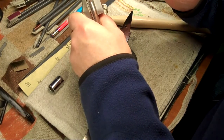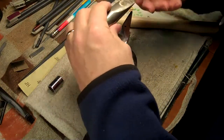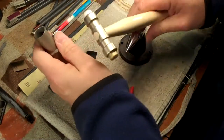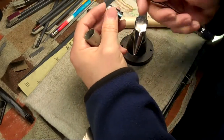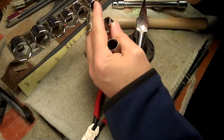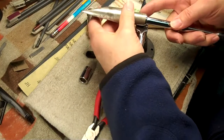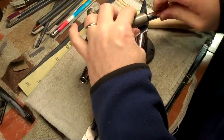That's up to 88. So you get the idea — I'll play around with that a little bit until I get close to what the client wants. Now the other area, the shank area — I discovered a while back, and some other guys have discovered this too — you can use something out of your toolbox: socket wrenches. These make a nice graduated set of all different sizes. You can find a couple there that fit inside your shank real close. This one fits a little loose, but this one here is actually kind of snug. This material is so soft that you can just roll it by hand on the anvil and get it a lot more uniform.